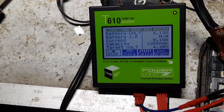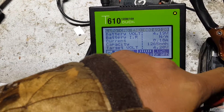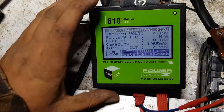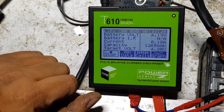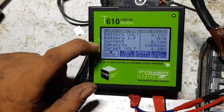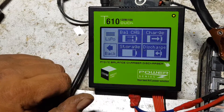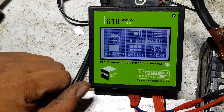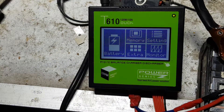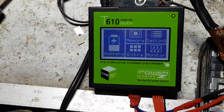First thing I can tell you about it is I've been using it quite a bit. What I've been using it for is bringing back LiPo cells in 18-volt Milwaukee batteries that are a bit sad. I've brought one up to 1265 milliamp hours. I really like its telemetry and its touchscreen functionality — that is actually really cool. We've got a pretty good view of the screen.